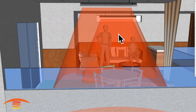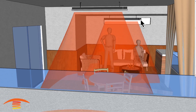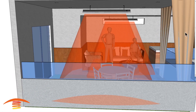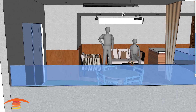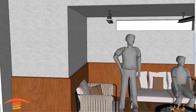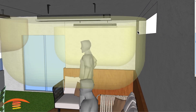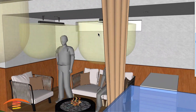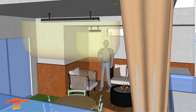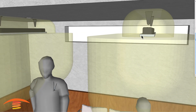This would be a fairly decent application. If you wanted both 4,000-watt units, you'd definitely want a control system, especially on the back unit. My recommendations would be 3,000 and 4,000 watts. Now let's look at a different option: still the 4,000-watt heater over here, and then two 2,500-watt units over here. The 2,500-watt units are shorter, so they fit in this span very well. We need 18 inches of clearance from the edge to the edge of the heater on all four sides at the bottom edge of the heater, and 6 inches above all units and 6 inches at the upper edge on all four sides.